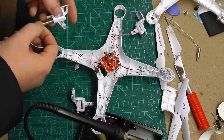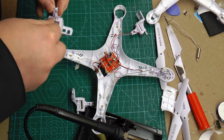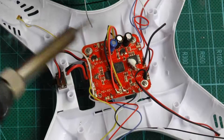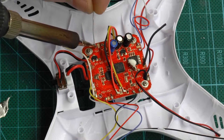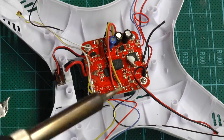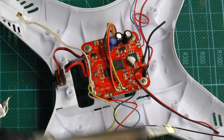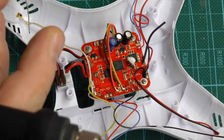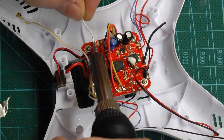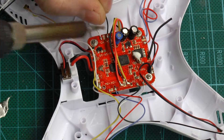I removed the bad motor and pushed the new motor into the compartment. Getting the wires through the holes can be a bit fiddly, but just be patient. I put some fresh solder on the solder tip and put some extra on the connecting points. You don't have to tin the wires when they're this small, but I always try to do it so I don't forget it when it's necessary. After that I soldered the cables onto the board — it can be a bit hard to see, but there's a print showing which is the positive and negative connection points.